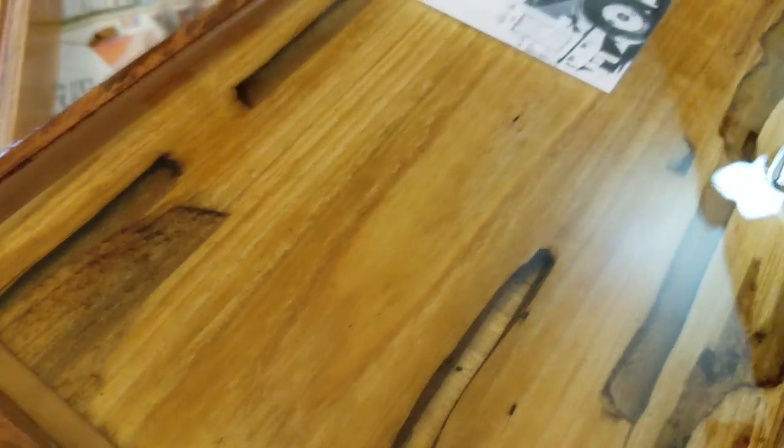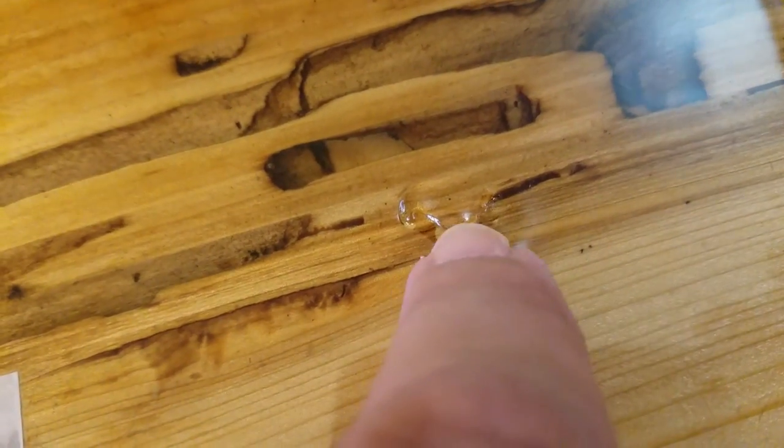And what happened is I did a sealer coat on this wood a couple days ago and got my paintbrush down in here and thought I got enough in these nooks and crannies to seal, and I pretty much did, but I had one little pesky bubble coming out of this crack right here. And I fought it with the torch for about 2 hours. Then I made the mistake of trying to pop a bubble with the little broken end on this little Hobbycraft paintbrush, and it stuck to it and pulled up.